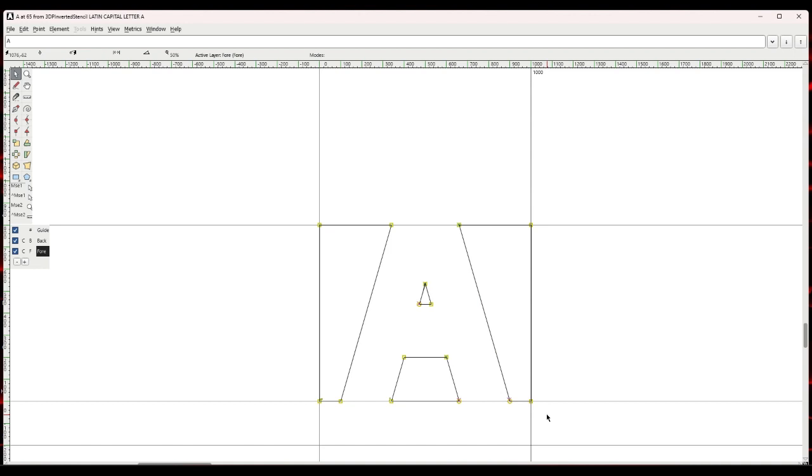So when I 3D print text, right? It's really, really hard to type words and then get the 3D printer to produce those words. I mean, it's not that hard if you put the words on the side of the print. But if you put them on the top of the print, you get a bunch of little islands that are annoying to print and a bunch of retractions, and it gets messy. And if you put them on the bottom of the print, it screws up the first layer so bad that oftentimes the print will fail.